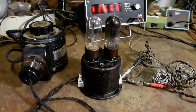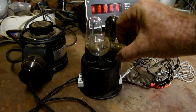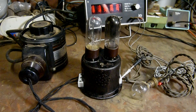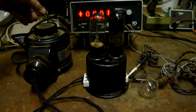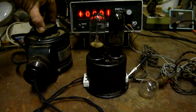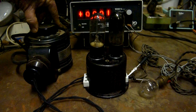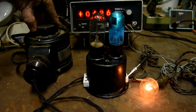I'll run the voltage up to the unit with a Variac and I'll just use one of these old lamps as a load for the output. We'll measure the voltage with a meter over here. We'll energise the unit now, just going to increase the voltage slowly - 80 volts, 100, 120, 140 - the rectifier will ionise very shortly. Here it goes - 160 volts. There we go, it's conducting.